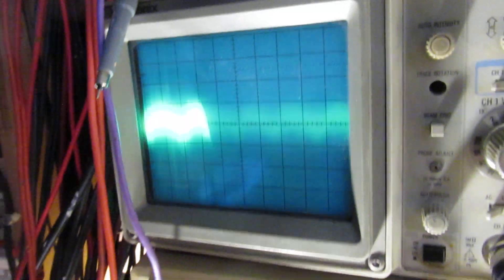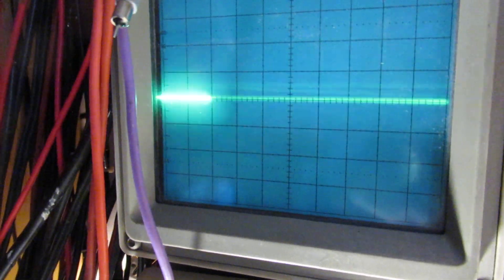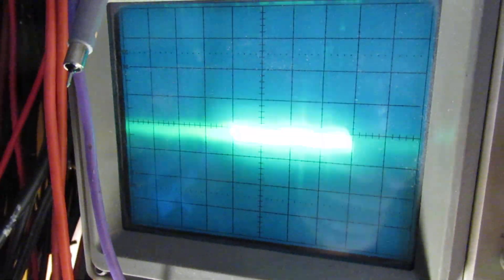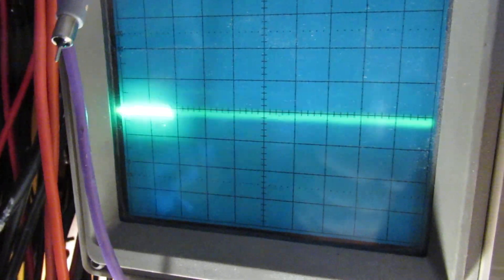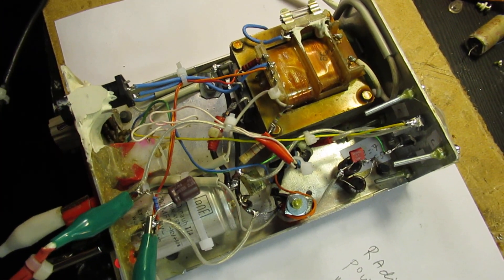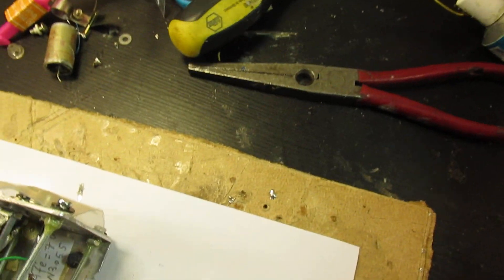When you go back to an even smaller voltage, you can see the hum completely disappears. I have set my scope to its utmost amplification, and this is the normal noise that comes out of the power supply. This tells us something about the quality of this power supply — and it means the quality is very high. That's not just my opinion; you can measure and test it.